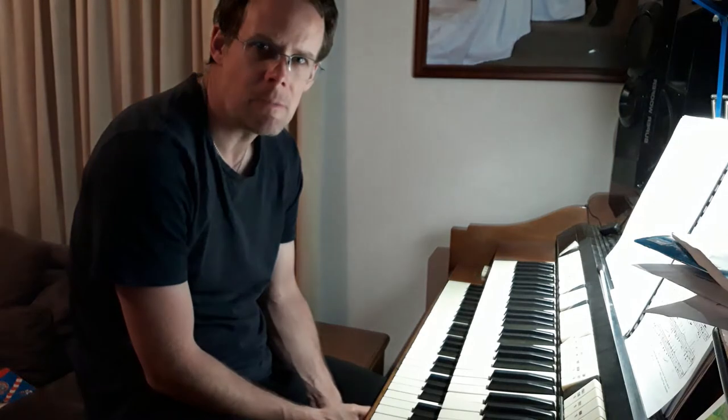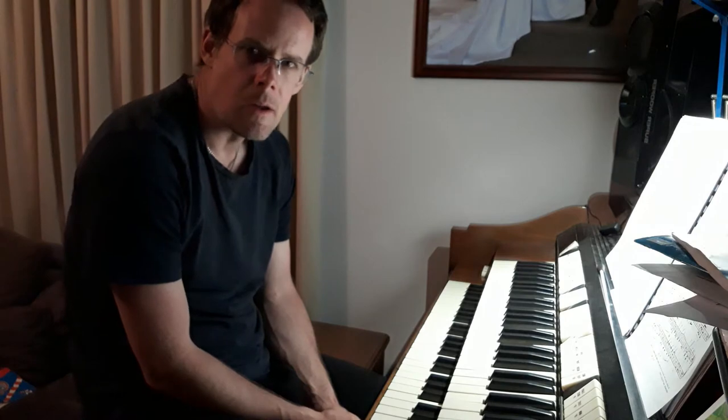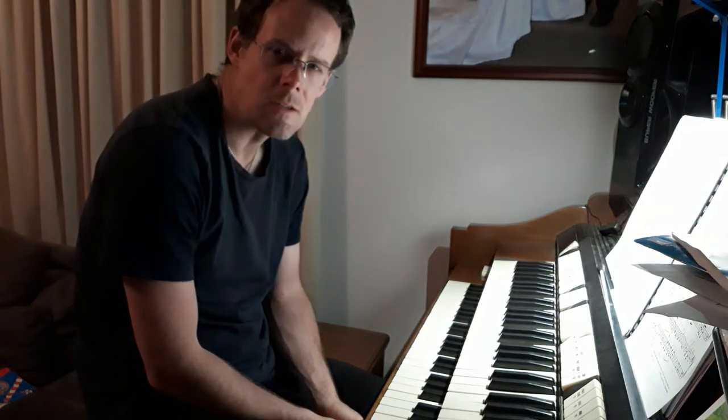The actual signal processing — the sound wave which you hear — is created using a box of reeds, like a reed organ or a mouth organ. It has a motor and a blower which is continually blowing air through the box of reeds. It also has electrical pickups on each one of those reeds, and the motion of the reed in relation to the electrical pickup generates the sine wave — so for those of you who are mathematically or signal-processing inclined, you'll understand what I mean.